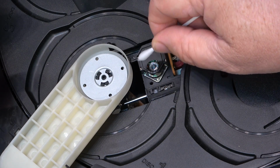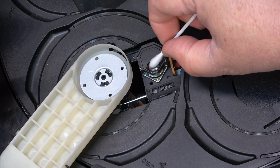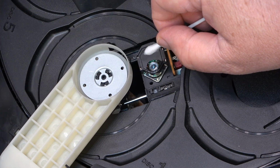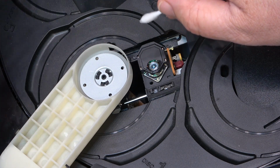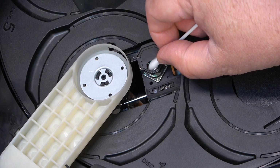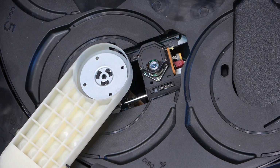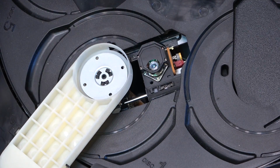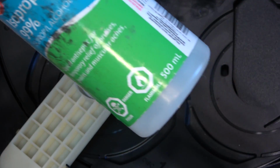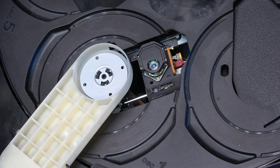Sometimes what will happen is if I'm using a toothbrush or something to clean up a circuit board, it may get contaminants in it. So I use this one more for general purpose cleaning, and then I have another one which is pure and it has never been in contact with anything else. And I use that for, say, cleaning optical pickups and stuff where I don't want to leave anything behind if there's any contamination. I doubt that there's any contamination in here, but because it's a bottle that I've refilled a couple times, it is my general purpose cleaner, and the other one is the new cleaner.